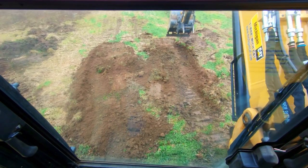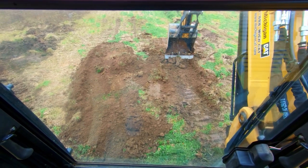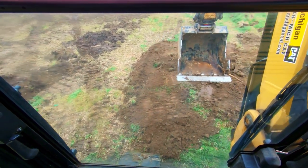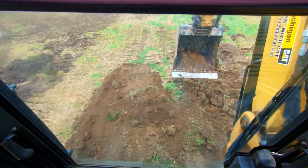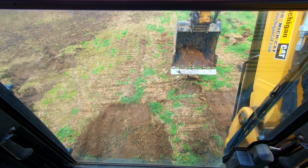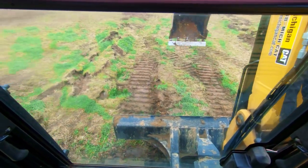Because we're so low over here I need to bring this side up just a hair, so we're gonna grab a little of this material and put it right there. Now I have four corners: my right front corner is gonna sit on this pile, my left front corner on this pile, my left rear corner on this little pile by our track, and my right rear corner is going to sit on the ground - virgin soil. So we're gonna track forward.